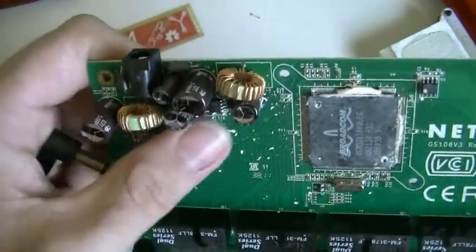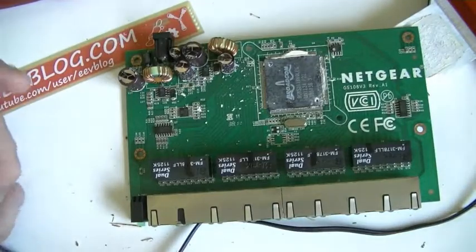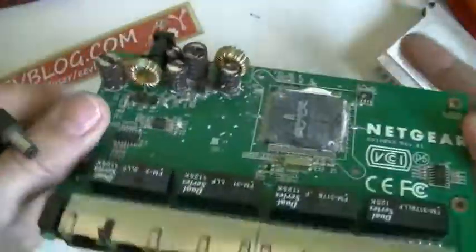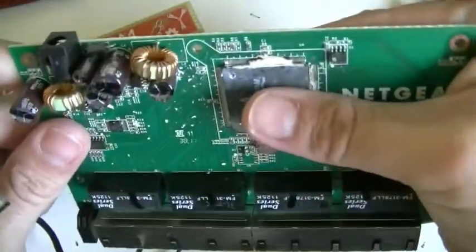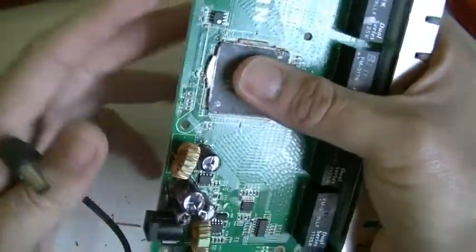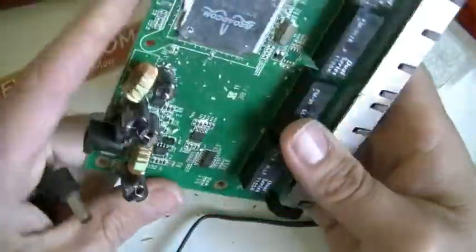It's quite possible that the switching part here is running too high a voltage to it or something like that. Interesting to try and measure this with the multimeter in line just to see what's going on, but I haven't got the leads to do so unfortunately. Not a lot going on there except the fact that that processor chip gets ridiculously hot. I mean, that was only plugged in for about 5-10 seconds and it accelerated from pretty much cool room temperature — about 18-20 degrees — up to a good 70-80 degrees before I unplugged it. So it's burning a pretty full-on amount of power just as heat.